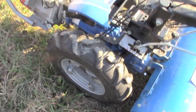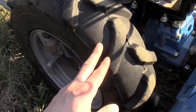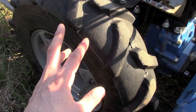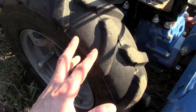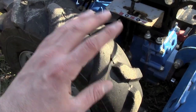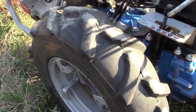I do have the metal cage wheels — you may see them for sale around the world. They're useful if you have to work soil that's a little too wet. I know everybody tells you you can't work soil wet, but sometimes you have no window and you have to get into the field. In that situation the mud will cake in and the wheels will spin, so the cage wheels can be good for that type of environment.